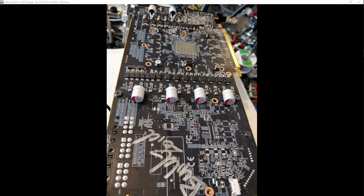It totally works. That didn't have as much of an impact as the Vega caps, or at least I didn't test it that much, but it slightly helped with core overclocking again. But the crazy thing about doing this was that it massively reduced the coil whine, which was not something I was expecting whatsoever. That wasn't even what I was testing for. I just noticed, whoa, the card is way quieter than I'm used to, and then it's like, oh, right.